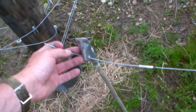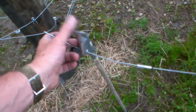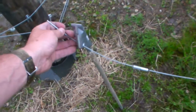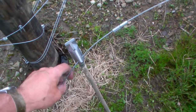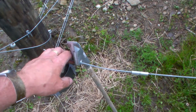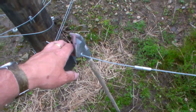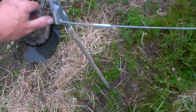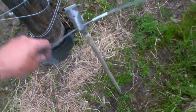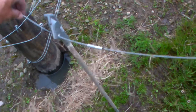These are really stellar anchors for holding down corner posts or posts that are in a dip — you don't want them coming up. This one is rated for eleven hundred pounds of tension, and I believe it. I'm really torquing on my high tensile wire and it works just fine. I recommend using a ground rod instead of buying their tool, because you can use it as a ground rod when you're done, and you can also drive deeper into whatever soils you have. A short four-foot section of ground rod is basically a third hand and it's really handy.